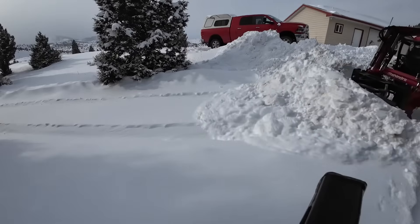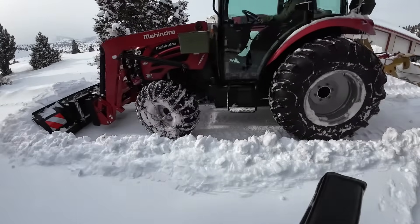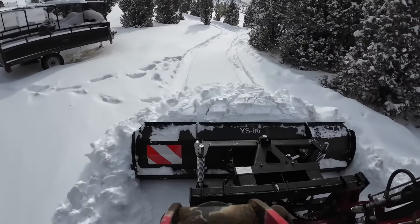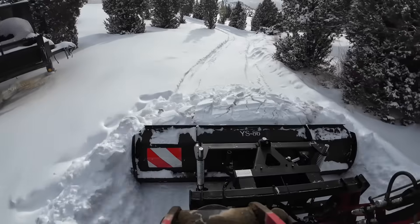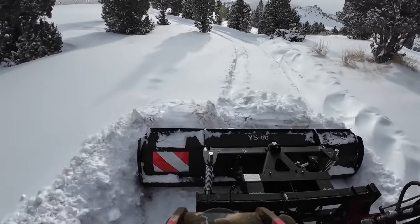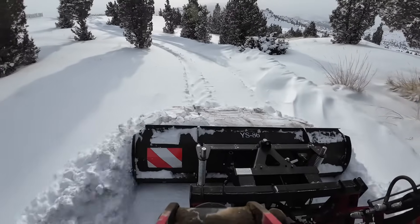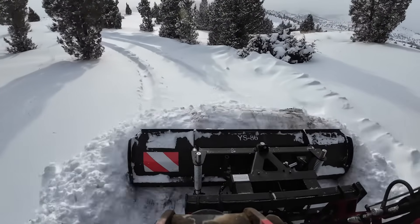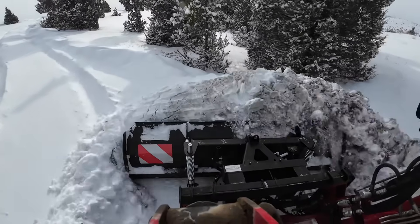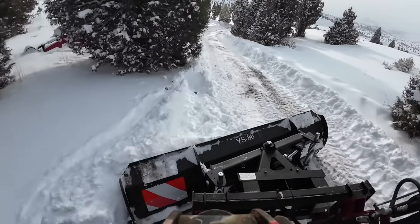This part of the driveway is all gravel and it's really irregular. Even though I've hit it with my land plane a couple times, it's still pretty bad going over it with the snowplow and just the straight blade — it just tears the heck out of it. I feel like a bulldozer because I'm moving so much dirt along with the snow. Here the pipe is really paying off and this is where I appreciate it the most. One of the advantages I really like about the pipe is even if you do hit a rock, it doesn't trip as badly as it does with just the straight blade. With the pipe on, it feels like less than half as bad. Here I'm making multiple passes down a little two-track trail we use to make circles on our property. It's V-shaped — literally a V. If we go down this with just the straight blade sticking down, it's catching and tripping all the time and jerking the tractor around. With the pipe it's going really smooth — just pulling up a little bit of dirt here and there, nothing like it was with just the blade.